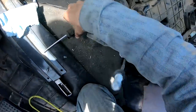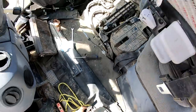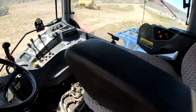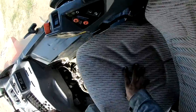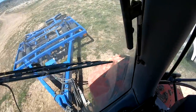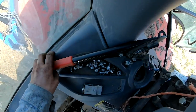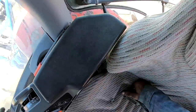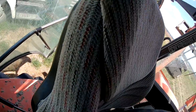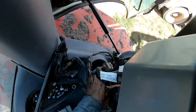And to be honest with you, this is a really, really dry climate. I'll be completely honest with you, half the time I don't even pull a 30-minute vacuum. I'll do about 10-15 minutes. It's a really, really dry climate out here. Now, if I was down in Redding with the humidity and all that, hell yeah, you better do it or you'll regret it. But never had too many issues with that up here. It's so dry. You don't really get a lot of moisture in the system, but sometimes if I got the time, I can do it. I do it if I can.